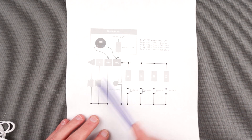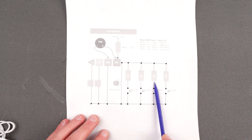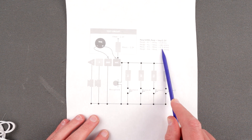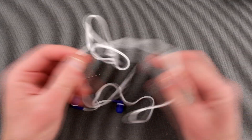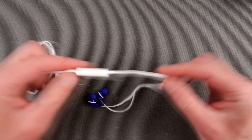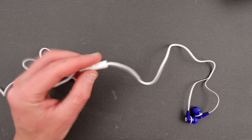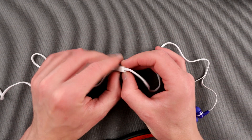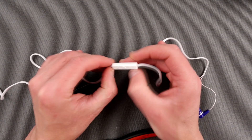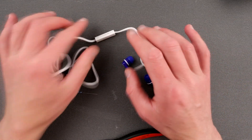So what we do: we remove the microphone, we remove that button, and we solder resistor R3 at 470 ohms. Let's bring our victim. As I mentioned, we don't care about the speakers — I'll be more civilized and open this rather than just cut it off. This particular headset was purchased at a dollar store for very cheap.